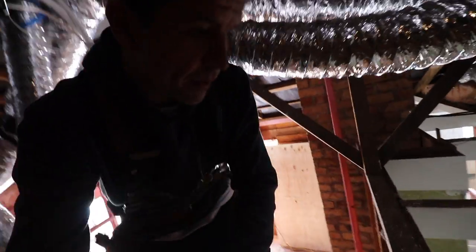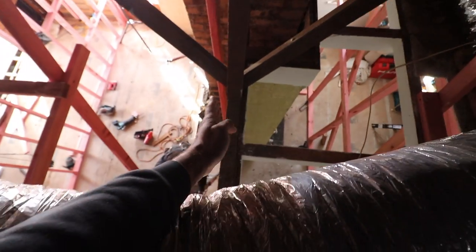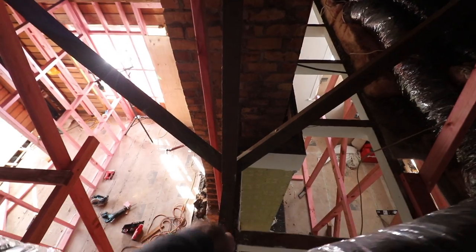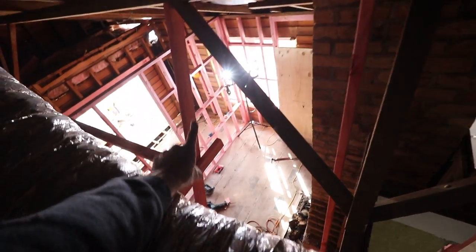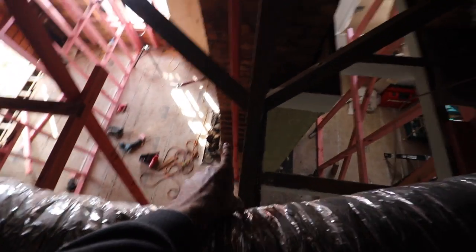We've done most of the propping here. There's one bedroom, there's another. And this wall is the wall we're taking out. This brace here is sitting on the wall, but we want it to sit on a beam. And that beam can't go in until this chimney's gone. So we've braced all the way down the middle here, just off the wall line.